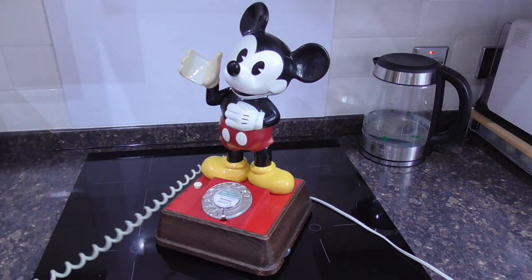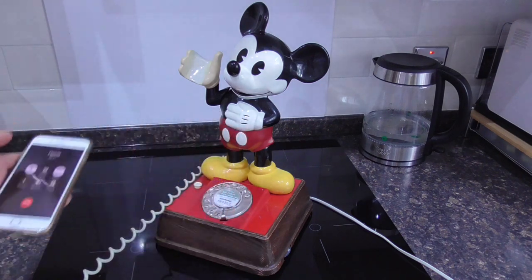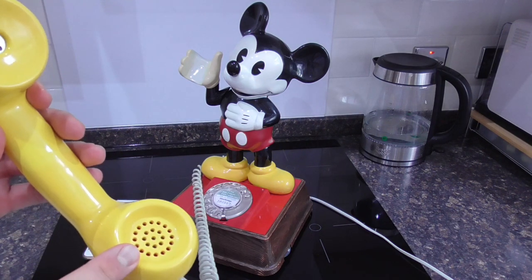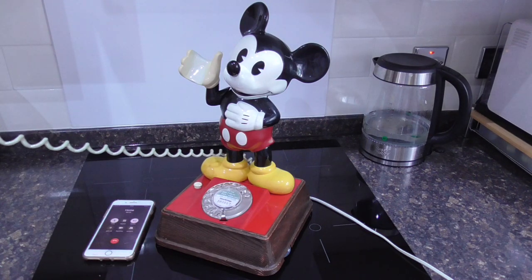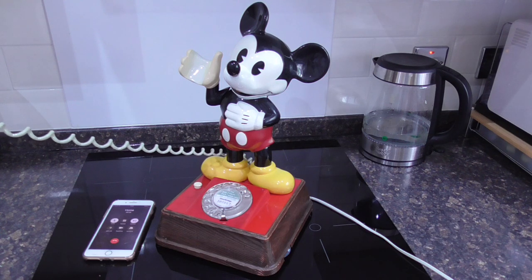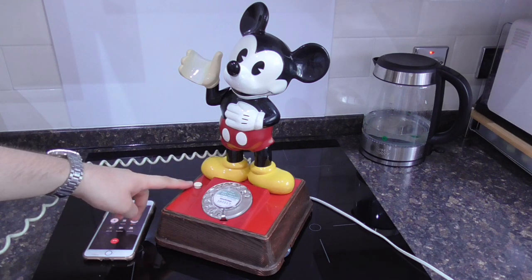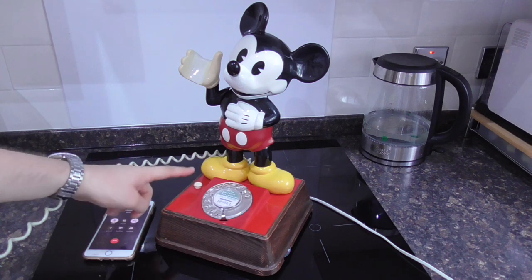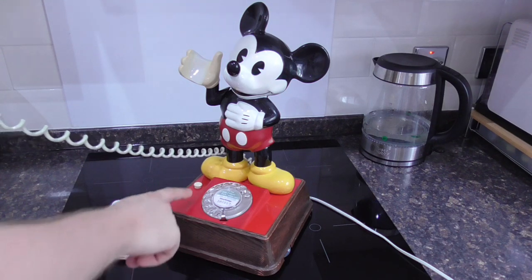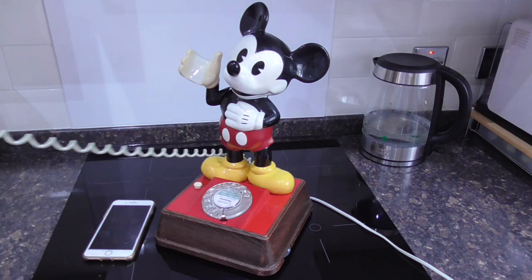Okay so we've answered the phone. What I'll do is put my iPhone on speaker, mute it, and transmit into the handset. Already you can hear it's picking my voice up. Hello. Testing. One, two, three. As you can hear, this is an electronic microphone and it's a lot clearer than the original carbon transmitter. Okay so now what I'll do is hold this button down, which will cut off the transmit, and I'll demonstrate that. So now you can hear me talking, and when I hold the button down, the transmit is completely dead. So that all works as it should. That's absolutely fantastic.